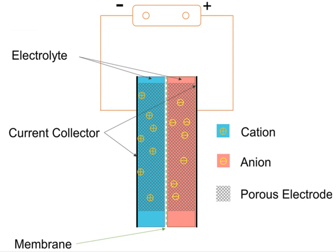The device was a three-dimensional (3D) sub-5 nanometer hydrous ruthenium-anchored graphene and carbon nanotube (CNT) hybrid foam (RGM) architecture. The graphene foam was conformally covered with hybrid networks of RuO2 nanoparticles and anchored CNTs. Less expensive oxides of iron, vanadium, nickel, and cobalt have been tested in aqueous electrolytes, but none has been investigated as much as manganese dioxide, MnO2. However, none of these oxides are in commercial use.